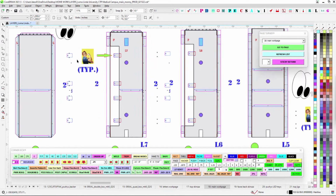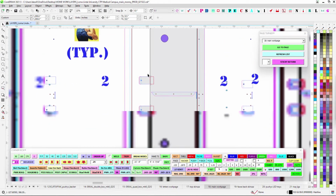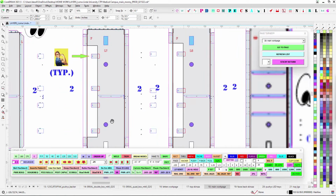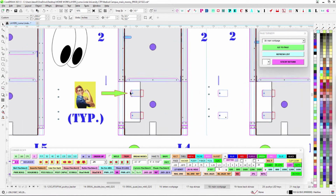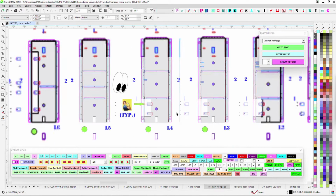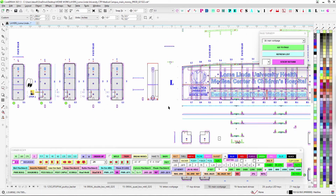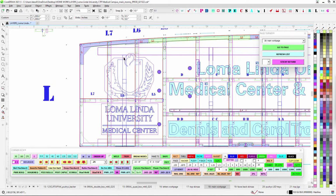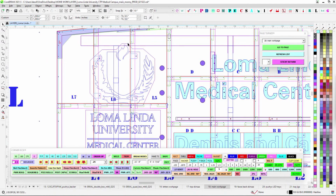You've done this before. Basically, you're going to be using muscle power to bend all these tabs over. Once you get these done in the brake, then you just hand bend these, and these pockets will be where the white on white slides right in for your push throughs. So you have a 5-inch deep pocket working at optimal level for LEDs, and then they'll just live in here. So you can see where it's notched there, it's notched there. So you're going to have a 5-inch deep pocket right in this area.